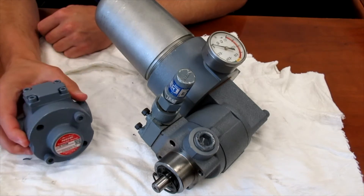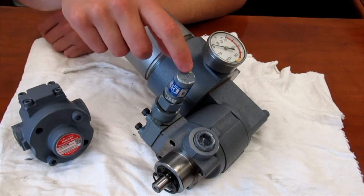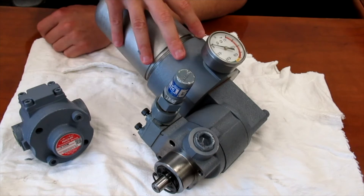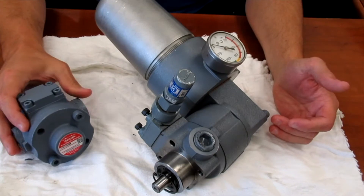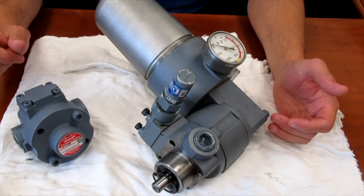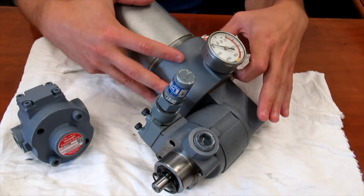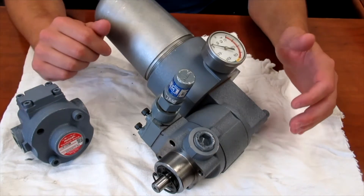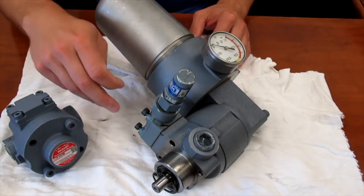You can get these anywhere from just the basic pump to models with several accessories. This one has a relief valve and a filter assembly on the pump. The basis of the pump is the same — if you add a relief valve, it just takes the place of this cap. If you have a filter assembly, it is ordered this way, so it's not something you can add on afterwards. So you have a basic model and then a few accessories.